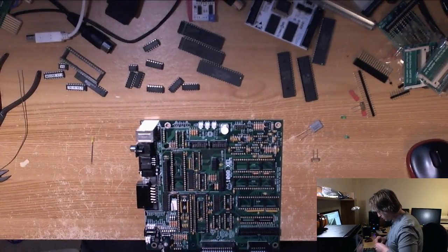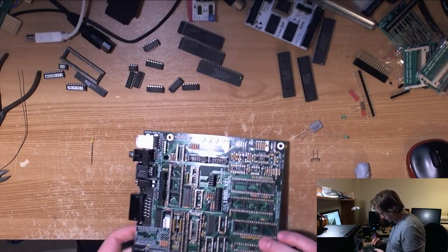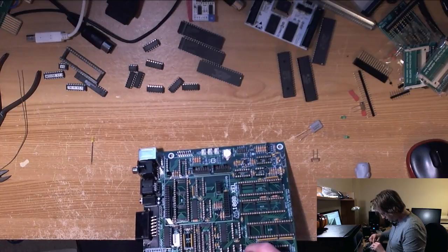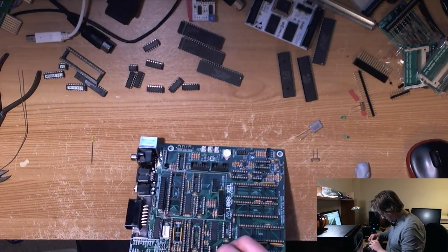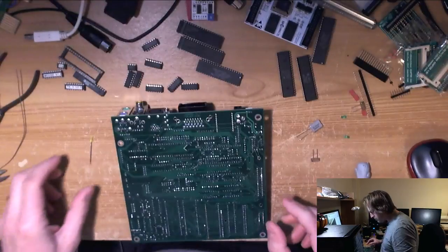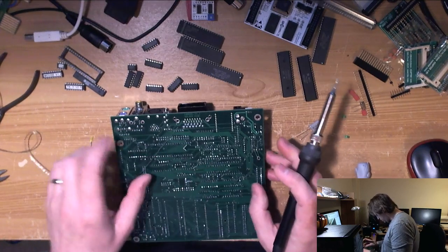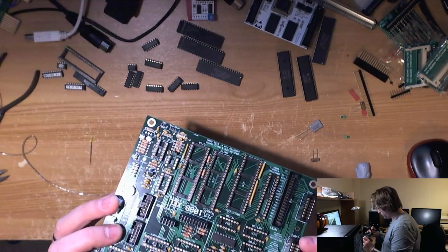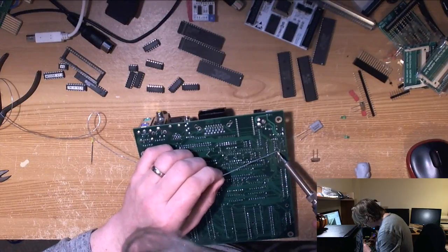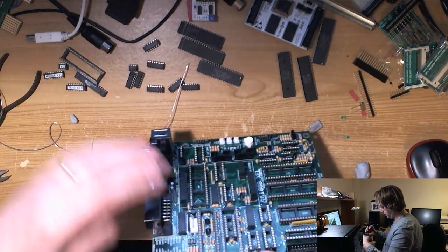The old blue tack. Yeah, square pad is a short lead. Correct. I forgot there is actually one side of the LED that is flat, which corresponds to the solder mask. Thing is with me, it's very rare that when I'm building something, parts actually go where they're meant to go. More often than not, it's going in a pile of hot glue or something. Okay, let's get this on. Do one leg and then press it down, make sure it's flat.